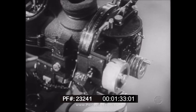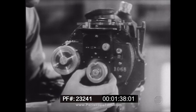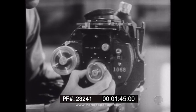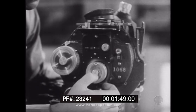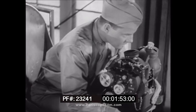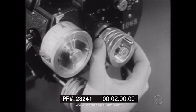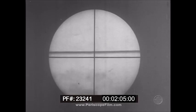So let's assume we're all set up with gyros running and all warmed up. How do you begin? Rate knob on the inside. Displacement knob on the outside. Clutch in your telescope and turn on your rate motor. Now see what you see. See how the horizontal crosshair is being slowly driven down? Turn your rate knob forward a couple of turns. See how you speeded up that crosshair?